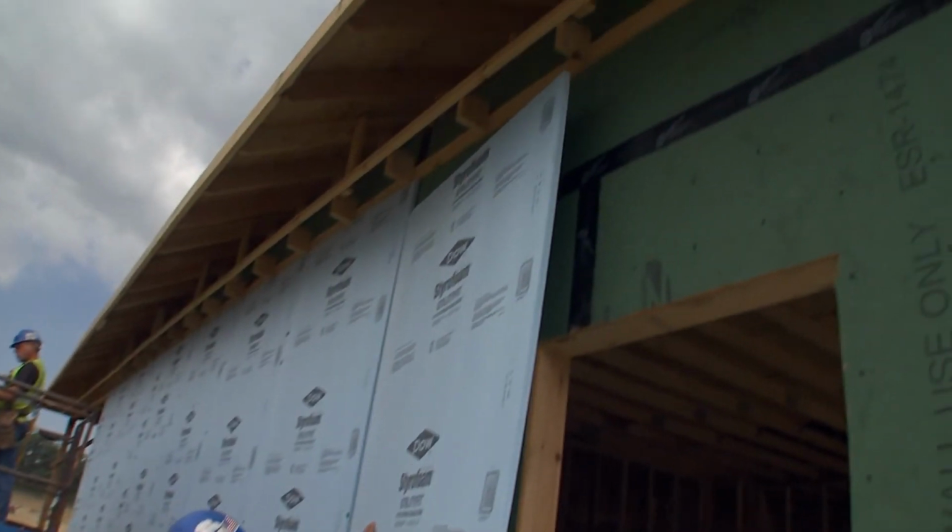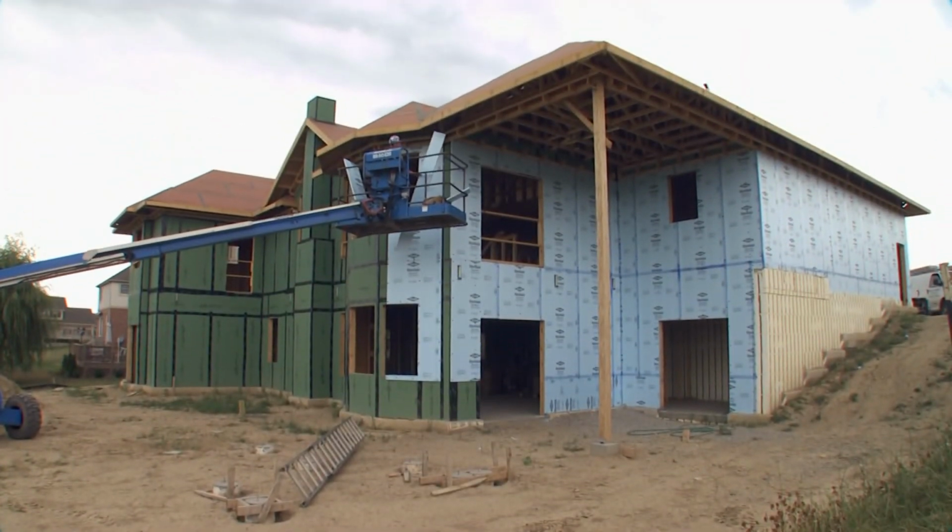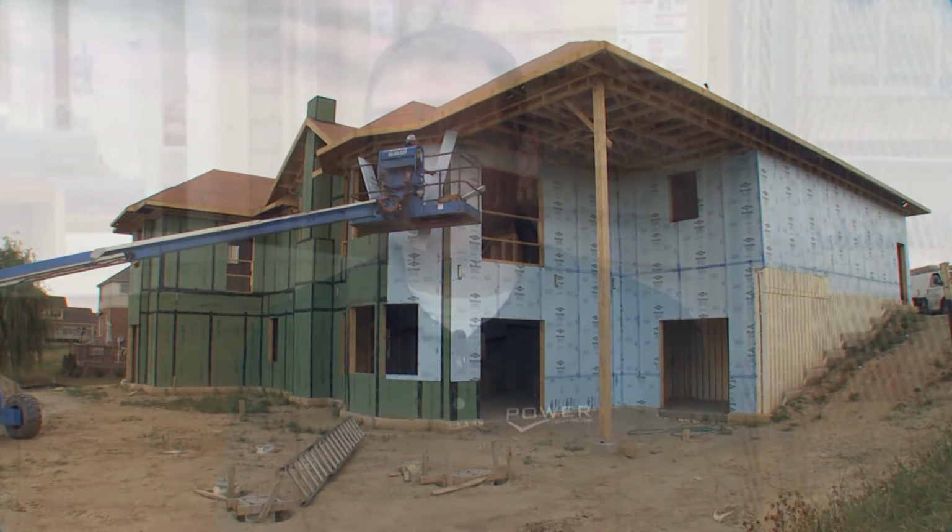If it's a peel and stick type product, it's all stuck solid. If you have things inside the wall, your insulation's on the inside, it gets more challenging, because then you can condense on the one side. Let's take a pool again. Everybody can relate to how humid that would be. If you have a pool environment, you have insulation in the wall, and you have a barrier on the outside, all that vapor wants to go out there and it can't get out. And then you have insulation on the inside, and now that surface is colder than it would have been if you didn't have the insulation in there.